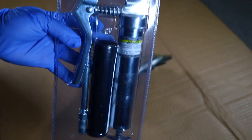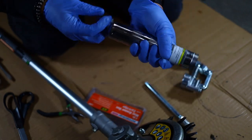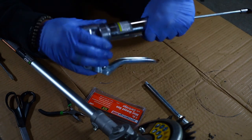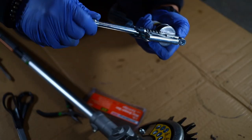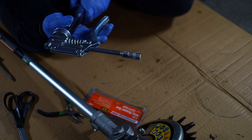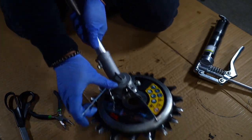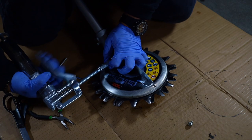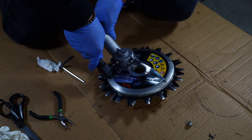I purchased this 3-ounce grease gun from Harbor Freight for about $10 — easy to assemble. Remove the bottom casing from the top and pull the lever all the way out, add your grease into the grease tube, then screw the bottom casing back onto the head. Screw the nozzle to the head and push the lever back all the way in until it stops, then squeeze the trigger until the grease comes out. Go back to the rotary scissors, remove the nut on top and the two nuts on the top casing, add grease to the top until you can't add any more, and add grease to the two holes as well. Then replace all three bolts.